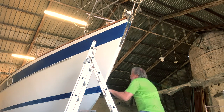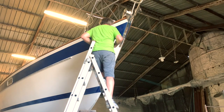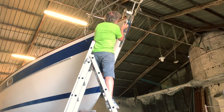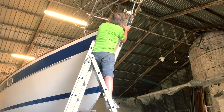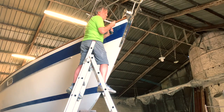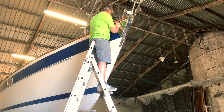You can see the bow of Ellös. Just near the bow roller, I will install the metal plate. To make this plate, I made a template with plywood and hot glue, and then made it in exact size and exact height, to protect the bow of Ellös when I lift the anchor.